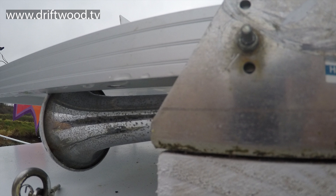When mounting these panels I had to reuse the old mounts because there was an old air horn on the roof that I didn't want to remove. To remove it I'd have had to remove all the panels on the inside of the roof, and first remove the wall panels - it was just too much hassle. So I've reused the old brackets and raised the panels about four inches up off the deck. If you're doing it yourself you won't necessarily need to do that. Also, we weren't able to tilt our panels due to the boat's layout - if you could tilt them you'd increase your amperage quite a bit, so try to mount them somewhere they can be tilted towards the sun.